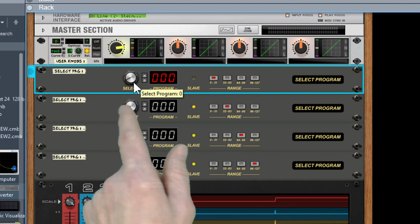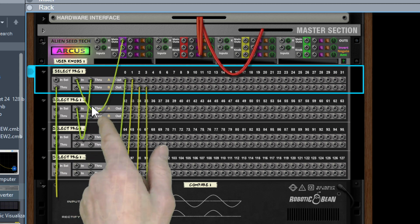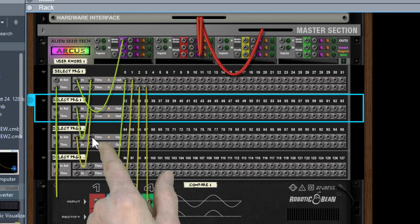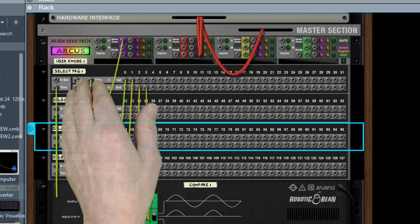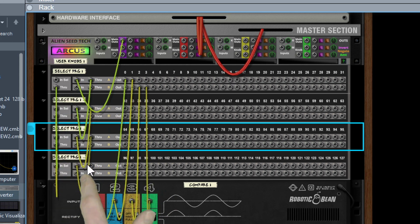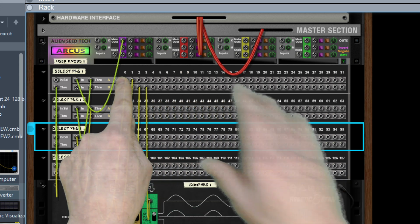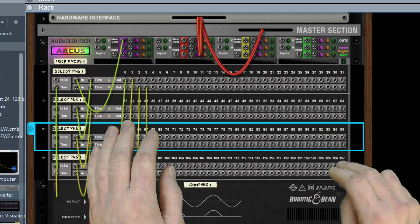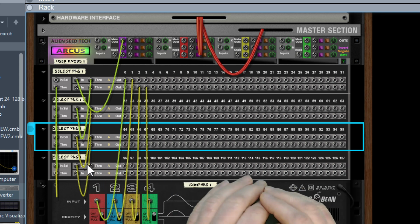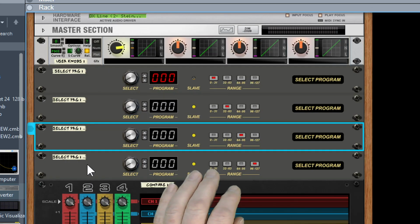Also, as I said, I could have a simple one in, and then obviously I can connect this through up into this in, this through to this in, this through to this in. And obviously I could do that through to the other ends as well. So whatever signal's coming in now is being passed through to all of these. And because of the way I've got it configured, as you can see, 1, 2, 7, and 0, we've effectively built ourselves a 1 in to 128 ports out. Okay, it's not at the same time, as I said, they're going to be selected. Okay, cool. That's interesting. Always good to know these sort of things.